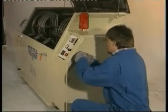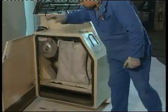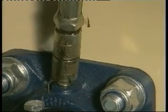The right hand bearing is located in the electrical control panel with access through the locked door. The left hand bearing is located within the extraction unit. The bearings need only a very light application of grease until it is seen oozing out of the bearing case.